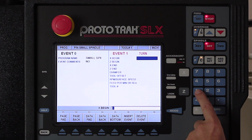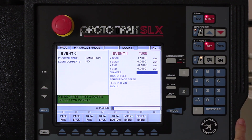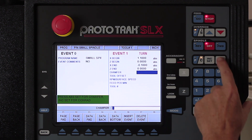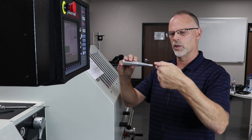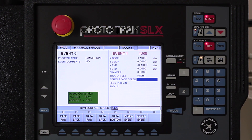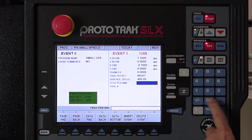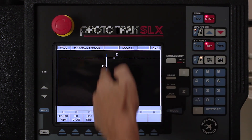I'm going to start outside the material. The material is one inch in diameter, so I'm going to start at 1.1 and hit my absolute key, establishing Z0 at zero. My X dimension I'm going to go a little past center to make sure the radius on my tool gets past the middle, so I'm going to go minus 0.1. It's asking if I want to use a chamfer or a Conrad, but I'm not connecting this to another event so I'll just hit the absolute key and leave it at zero. My tool offset — the tool is to the right of the piece part, so I'm going to use one for right. I'm going to program in surface footage at 400 surface feet, and eight thousandths per revolution, using tool number one. When I push the look button, you can see my first cut to face the part.